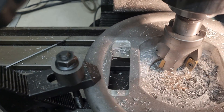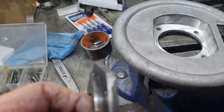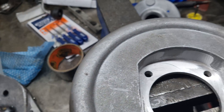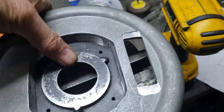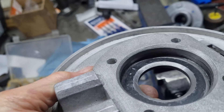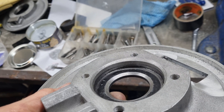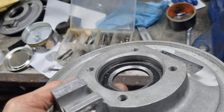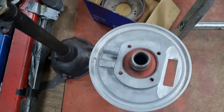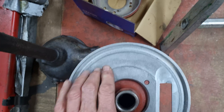After you've found the top of the job you can then swing it back and forward and gradually work your way out without damaging the casting. Here's a test piece I made up for checking the fit — this is after it's come out of the machine. You should be able to stick that in there with no gaps between the test piece and the casting. If you don't relieve the casting draft, it won't fit properly. Here it is on the actual diff — it should be a nice snug fit without any rocking.